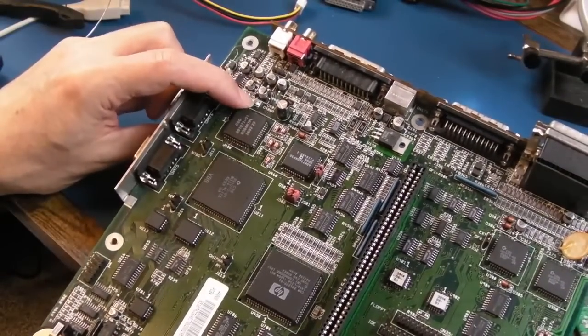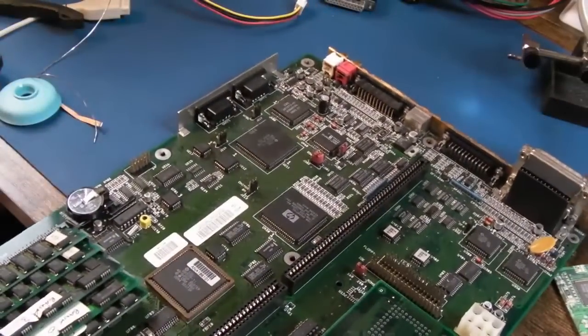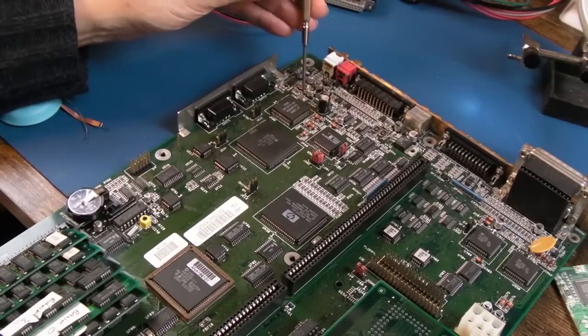That's what's caused that resistor to fail. A bit too much current through a 1 ohm resistor, as I've said so many times. It kind of acts like a fuse. So, yeah, anyway, the 1 ohm's been replaced. We'll get that off next, replace that.